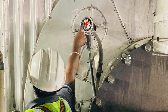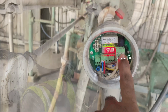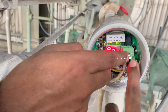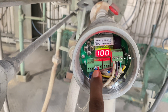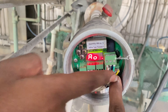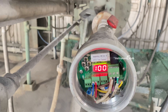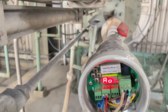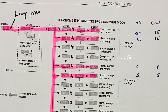Next, have a look at cable connection and termination — how each cable is connecting, all visible in the field. The white cable connection is fault, the black cable connection is common, and the green cable connection is flame on. These three connections go into one block. The red and blue cable is communication, the lower cable is power cable, and the brown and yellow cable is analog output. 24V DC external power energizes the scanner.